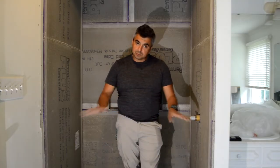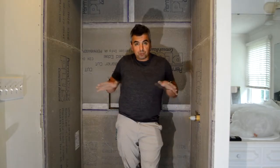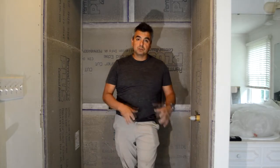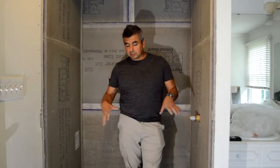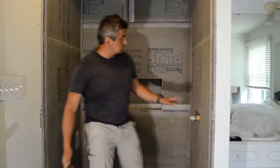So what happens is that when you build that in that way, with a nice inclination towards the drain, you guarantee that when water seeps through, even though the water's going underneath, it's actually going through the weep holes of your drain. And I have videos where I show all that stuff. I'm gonna make even more interesting videos about the topic, right? So that is important.